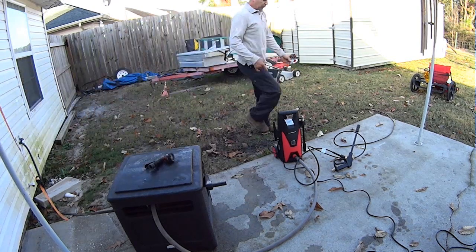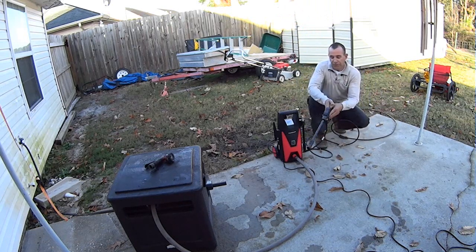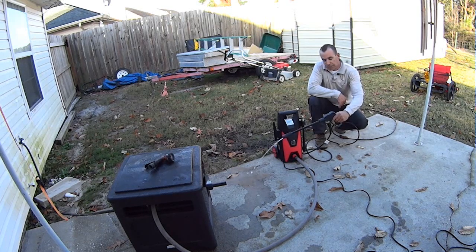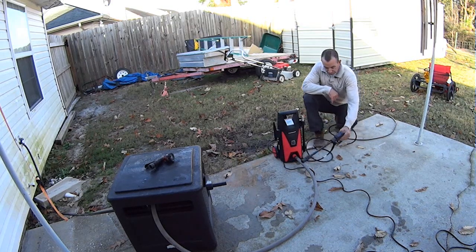So right now, water's going through, but it's only going to go so far, and then the air is going to stop it. Did you hear the air? Bleed the system. Now we've got good water going through. The system is now bled. Now you're ready to start work.